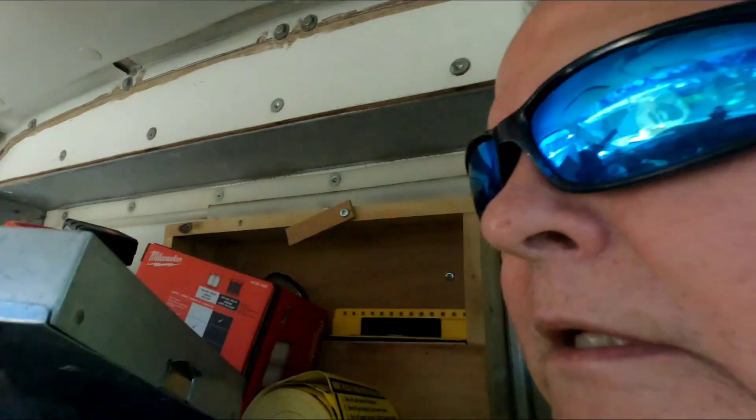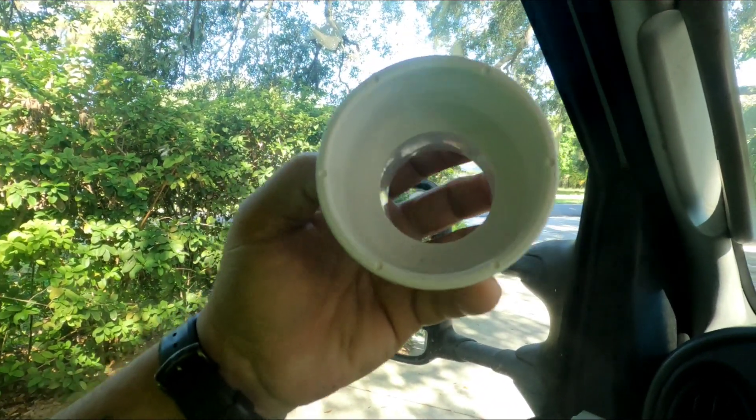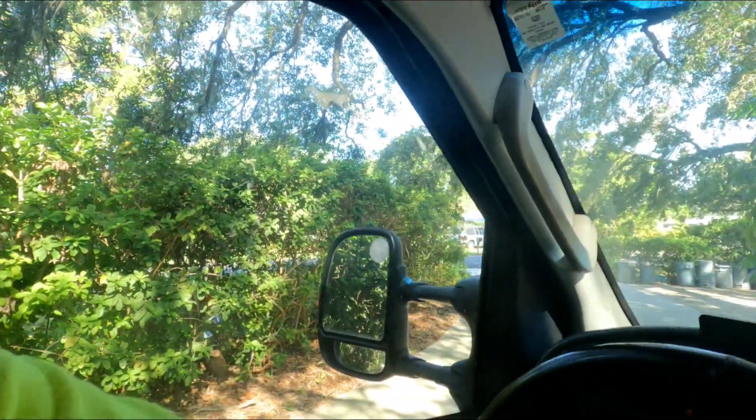This fitting right here is for two-inch down to inch-and-a-half for the kitchen — they do sell one for inch-and-a-half so I need to go pick that up. I'm also gonna grab a 60-pound bag of quick-set concrete. I've got my right-angle drill and a mixer; I'll mix that up in a bucket after I've got the whole thing prefabbed and marked out with pencil marks, then I'll pour it on the floor and set that tub in it, screw it in, and head on down the road. That stuff sets up in like 20 minutes so you gotta be quick.